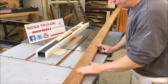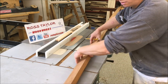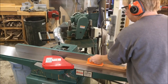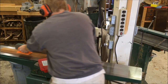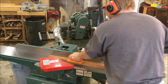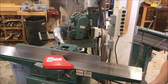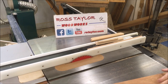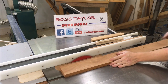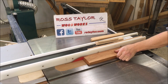I'm ready to start making veneer. I've got this really nice piece of figured cherry I'm going to use, and I'm marking out the pieces I need. Here we're going to rip the strips for the rails — I've set the fence to three sixteenths of an inch, and the board is milled to just a little bit thicker than the rails.